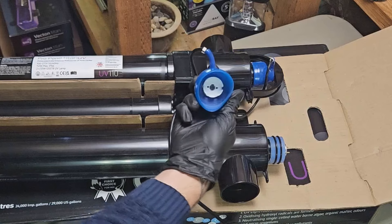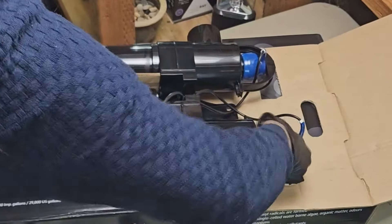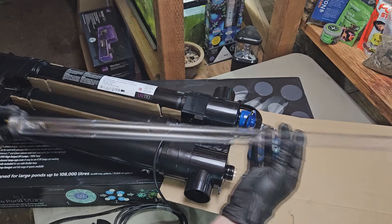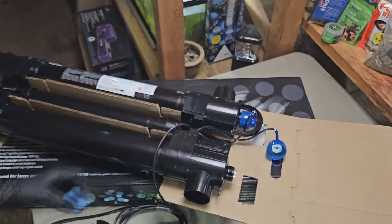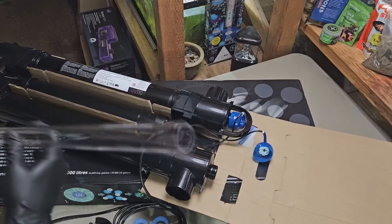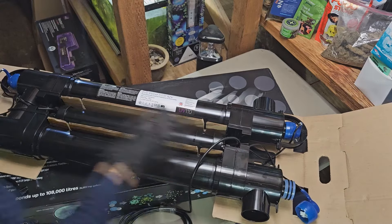TMC gave us the same design as the TMC Advantage, but now with the Titan we already know how to service it. Two long T8 lamps, which is important because T8s are better than T5 with more surface area and the lamp gap to the inner wall is narrower, plus plugged into electrical on both sides of the lamp for no intensity drop off. The two lamps are parallel to each other, which allows the water to travel along the lamp for the max amount of time for the wattage lamp. It can be hooked in series, or for serious inquirers there are commercial units that are 220, 330, and 440 watt sizes.